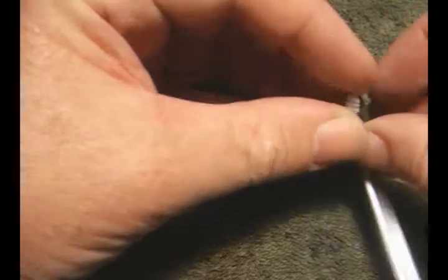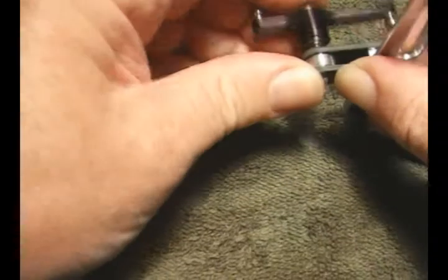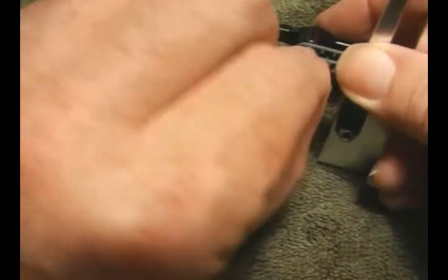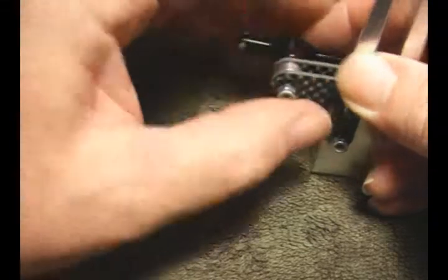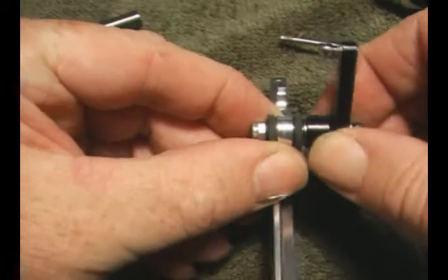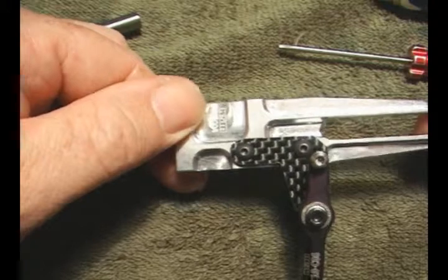First of all, we need to put this aluminium spacer down, flat non-machine side pointing to the front. Pop the bolt down and mount up the lever arm, and then we can secure those with an M3 washer and an M3 lock nut. Now we've got the M3 shaft going through the lever, we can now tighten up these bracket mounting bolts on the anti-rotation device. And that's the M3 shaft bolt done up enough so that there's no end play, but it's quite free to spin round, and our two levers secure on the anti-rotation bracket like that.